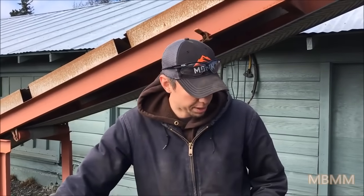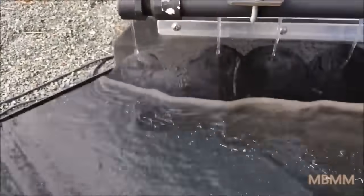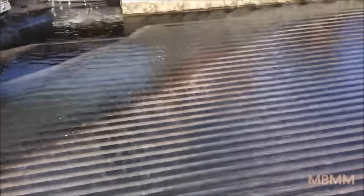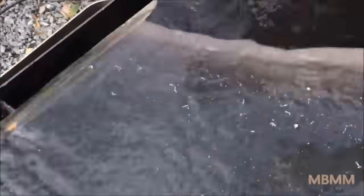We've run our shaker table a little bit here and you can see the big band of black ferrite — that's actually dense enough that it's working its way up onto the cleaning plane and down into the number one concentrate port. You can see this finer gray stuff here, which is probably lead or tin, working its way up onto the cleaning plane and coming down into a nice band right into the number one con. Down below the ferrite, this is probably aluminum or your lighter base metals. The copper wire surprisingly has enough surface area that it won't settle into the grooves, so a lot of your fine copper wire is coming down into the number three middlings, and your finer copper and some pins are coming into the number one and number two mix.